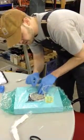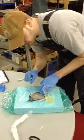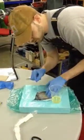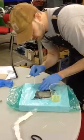Now this is a thinner fiberglass backing over the core material and the carbon on the inside. The mold side is typically the inside. Although tomorrow we're actually going to do male mold, it'll be reversed. But yeah, there was enough to wet it out all together. Just pressing it on, so I didn't have to pour more.